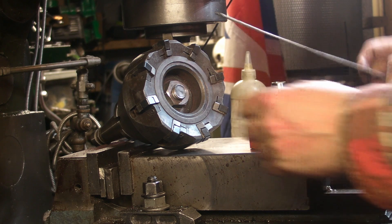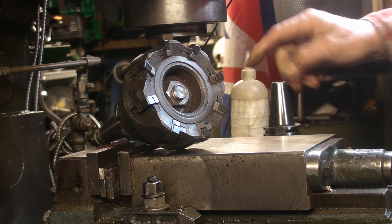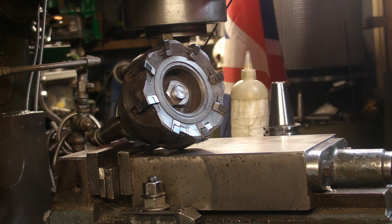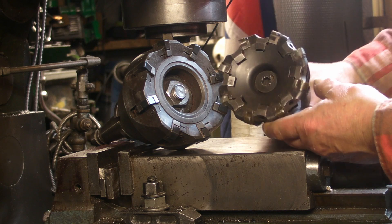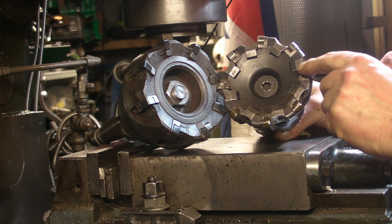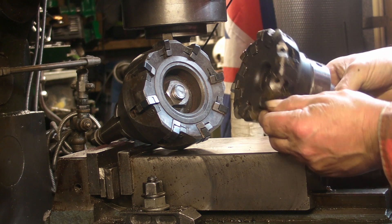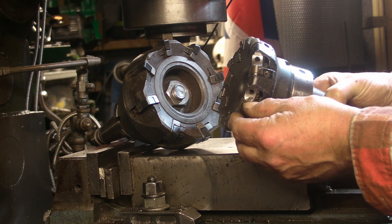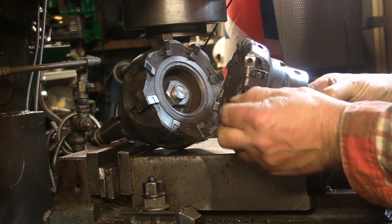Now this is a 5 inch diameter and the inserts on this are square ceramic. I have got a similar one that's the same size and this has circular inserts - again ceramic. They're getting a bit past their best, but with them being circular, undoing the set screw and just turning them slightly will give you a clean cutting edge on them as well.